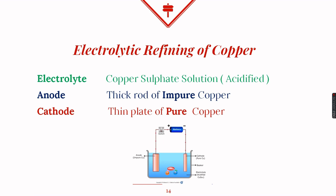For the purpose of refining, the three things — the electrolyte, anode, and cathode — should be of the same material that is being refined. As we are refining copper here, our electrolyte will be copper sulfate solution. As anode we have taken impure copper, while our cathode is of pure copper.